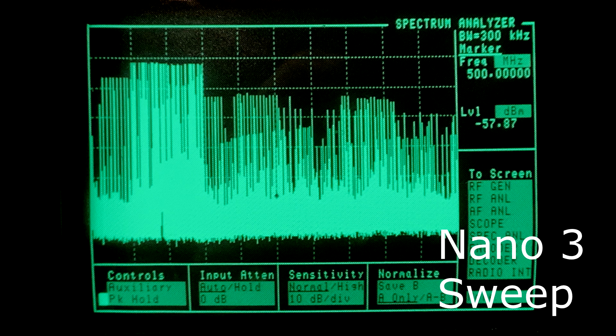The spectrum analyzer is set to peak hold mode. The NanoVNA outputs very small pulses of various frequencies, so you need to let the spectrum analyzer run and capture data for a while. This is set between zero and one gigahertz. At lower frequencies, 300 megahertz and below, the power level is up around minus 12 dBm. It drops to maybe minus 22 dBm in the middle frequencies, and at upper frequencies, 800 megahertz to one gigahertz, it's measuring about minus 30 dBm.